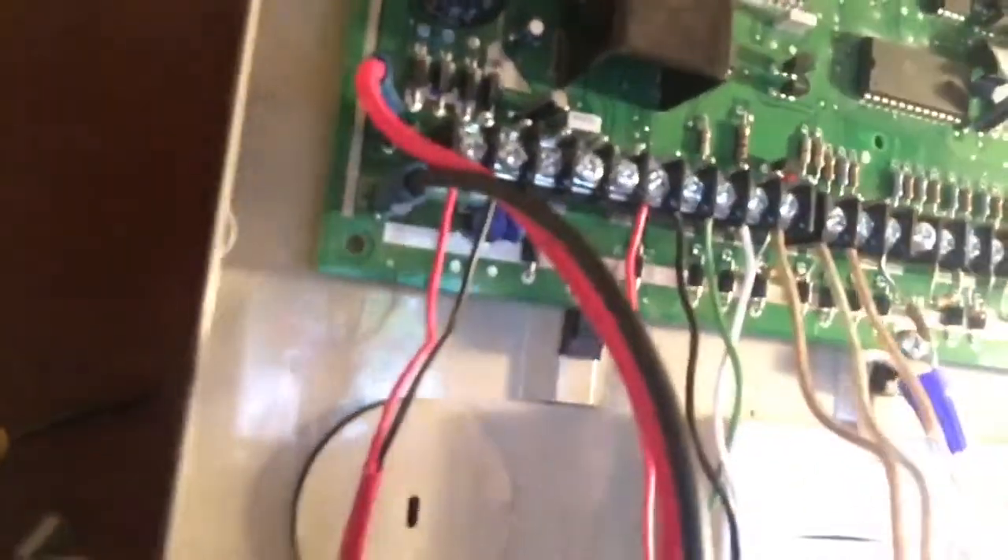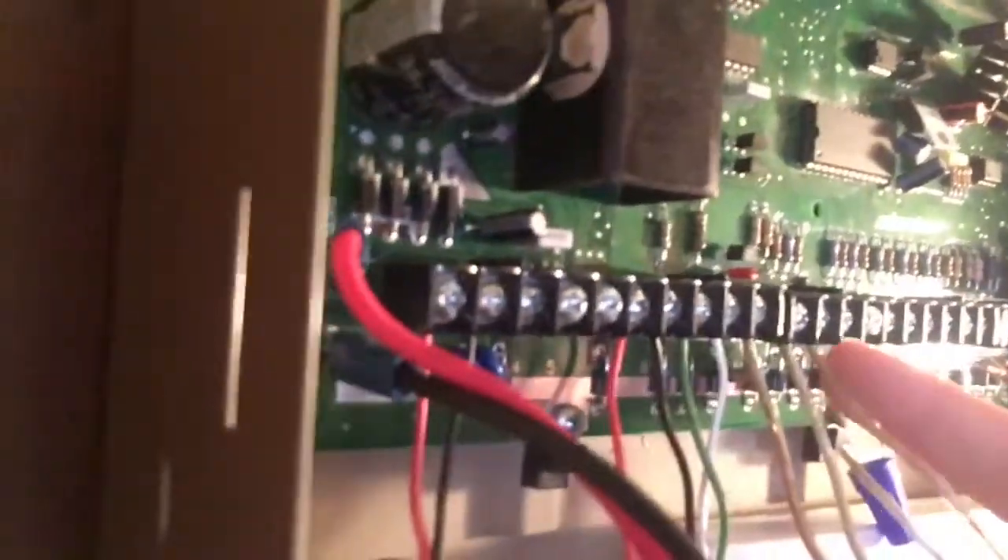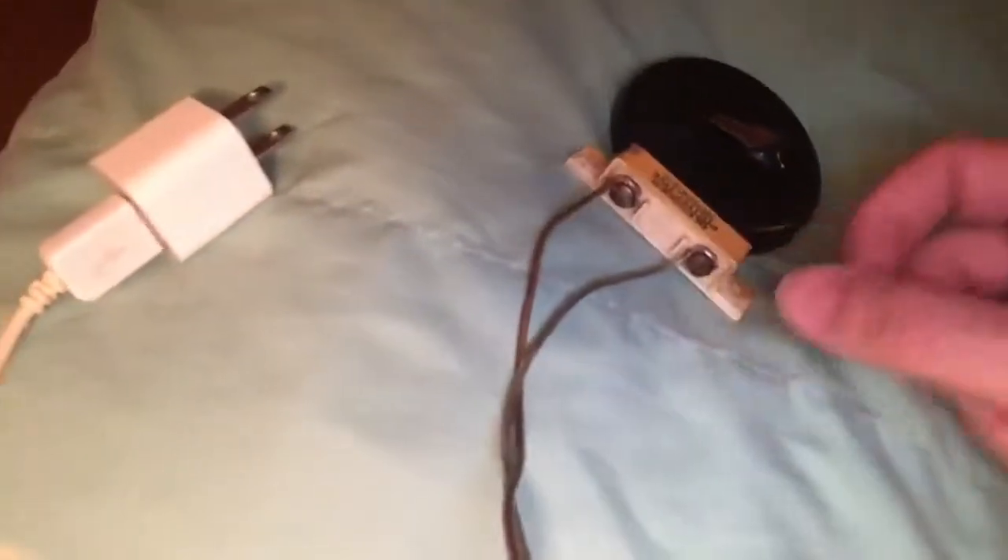As you can see, for zone 2, it's totally separate from these two screw terminals here, which is for a two-wire detector that I have already programmed. This here is for door contacts and other sensors, like motion detectors, etc. So we have this wire that goes all the way to our door contact sitting right here, and I just have a magnet right here. This is how you want the resistor set up as well — on the silver wire, it is capped to one side of the resistor, and then the other side of the resistor goes straight to the screw terminal, which is how you want it wired up. The wiring on the door contact itself is fairly simple — you just hook the wires up to it.